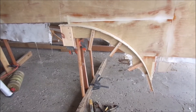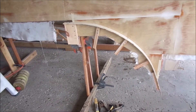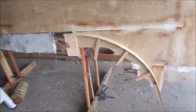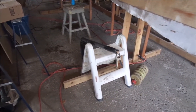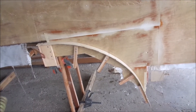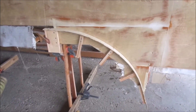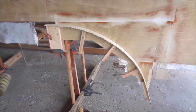One of the things I decided to start working on was the support mechanism for the front bow that curves up. In the plans they use fir and just put cuts about every inch and carefully bend it. But I decided I would build a little form and then steam some oak — and there's my little steamer there starting to heat up. I'll use two pieces of quarter-inch oak, steam them, and then later epoxy them together. They will be nice and solid, permanently formed in an arc, and won't lose that shape. I'll do two on this form, one for each hull.